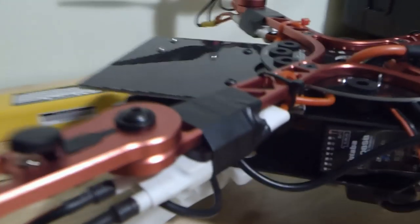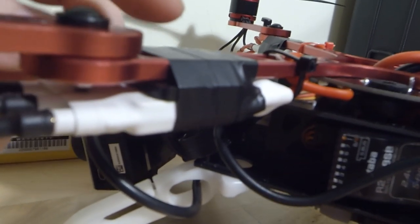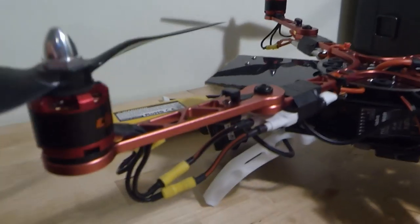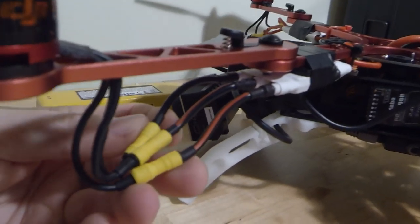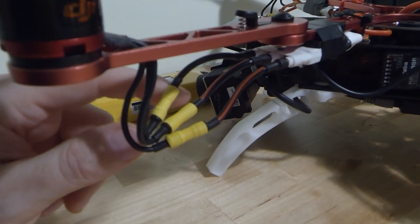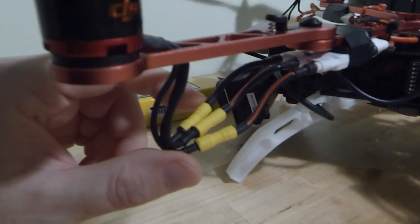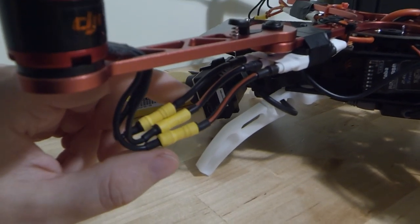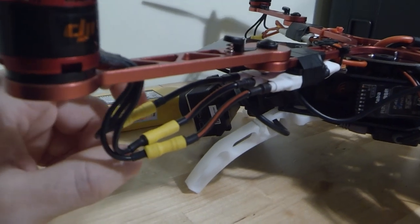This is the best place for the ESC. The manual says get some foam; I use a little nylon spacer just to bridge the gap out a little bit so the nut isn't impacting the ESC. The other thing you're going to need to do is extend these motor arm cables. The manual doesn't actually mention this until you read all the way down and see a little note saying 'by now if you're a DJI motor owner you will have realized the cables aren't long enough.' It doesn't say how long a piece of cable you need or whether you need bullet connectors.